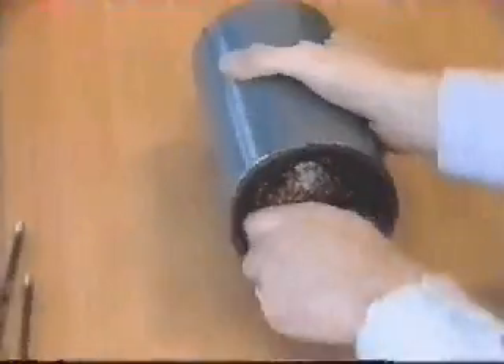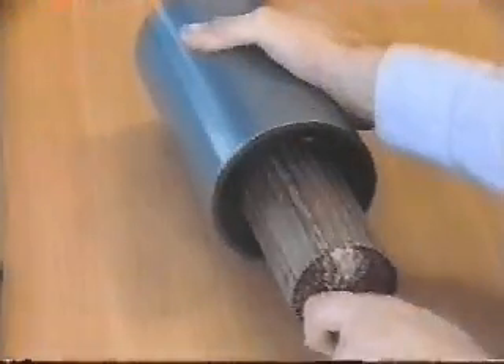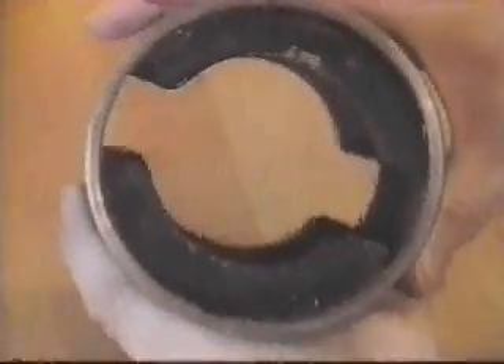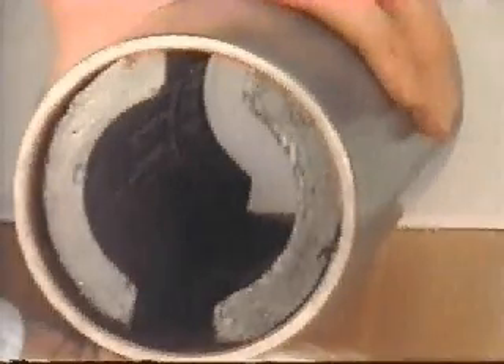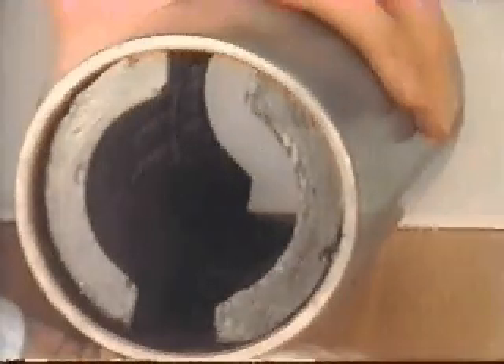The two very large permanent magnets mounted just inside the casing pose a formidable challenge for the dismantler. The faceplate bolts lie in the gaps between the magnets. The markings on the inside surface of the magnets are from machining — they're not functional. The two-magnet construction makes this a two-pole motor.